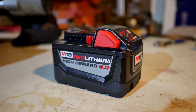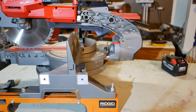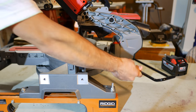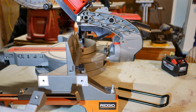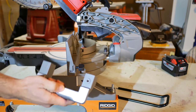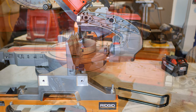The kit also includes the rapid charger. This saw is about 95% ready to go out of the box — really all it needs to get going is to install the blade. The additional items like the two side handles and the rear kickstand still need to be installed. The kickstand goes in the back and helps prevent the saw from tipping back when the blade rises quickly. The side handles offer nice wide grips and also act as extensions, but since I mounted mine on a miter saw stand I didn't need them.